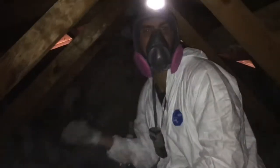Now this is all cellulose that we're adding to this attic, and there's a good reason we use cellulose. It has really good insulation property, R value, but also helps air seal because it doesn't have the air gaps that fiberglass has. Totally non-toxic. Check them out. Rub it on your face, and all you get is dusty, not itchy.